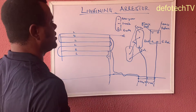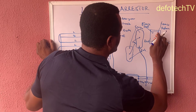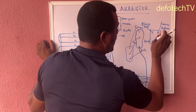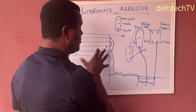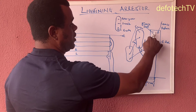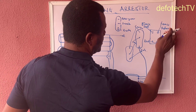So linking of this is to get your out from your fence — this is the out terminal. This means the fence loop needs to be opened when we do our connection. You need to open it up. There's no way you keep that connection closed, else your fence would not work adequately, because if there is any cut there's a loop and it won't raise an alarm. So we need to open this up to understand these are fence out and these are fence return.